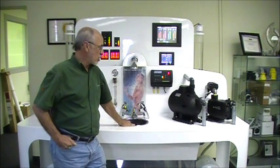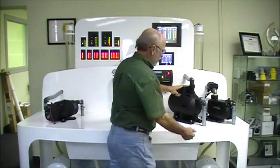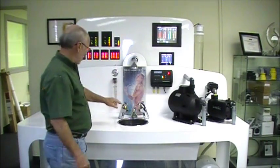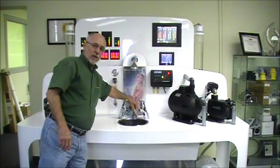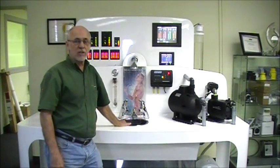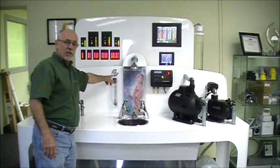So this is accomplished by: if the pump is on, turn it off. This pump will be already turned off. After you turn the pump off, open at least two or three faucets on the boat and let the pressure go away. Just let it run until there's no pressure on the system or until your gauge says zero.